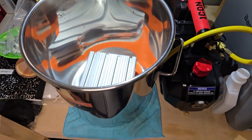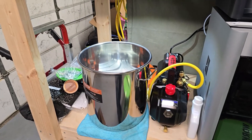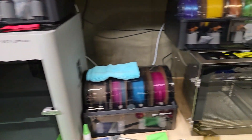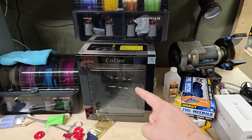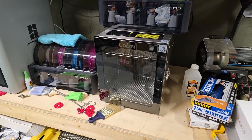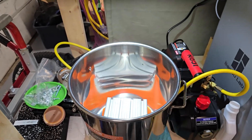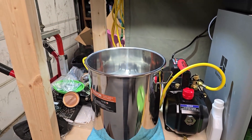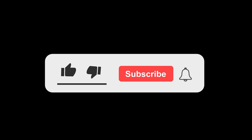So folks, there you have it — a vacuum chamber as a dehydrator. It took about 30 minutes to dry that PCB out efficiently. Next, I'd like to try it with a cell phone. With a cell phone, that's where conventional methods will never work, because radiant and circulating warmers just won't penetrate a contained space. That's why you've got to move to vacuum — vacuum penetrates inside a case and will boil off all that humidity. Fantastic results. If you enjoyed this video, don't forget to give it a thumbs up and subscribe for more content. Drop a comment below with what you'd like to see in future videos.